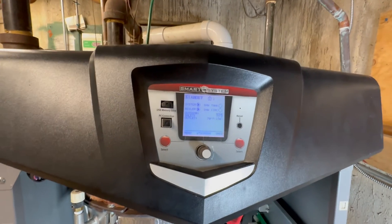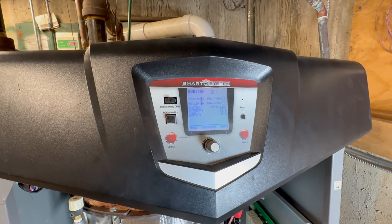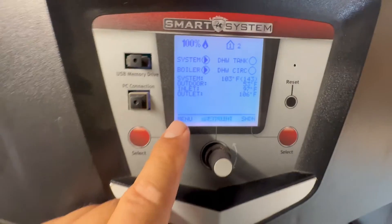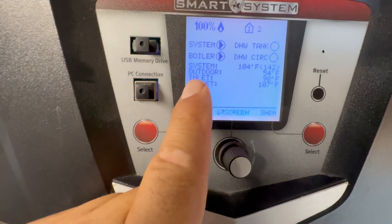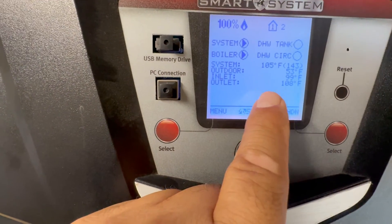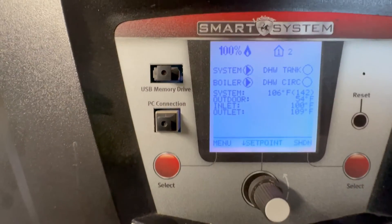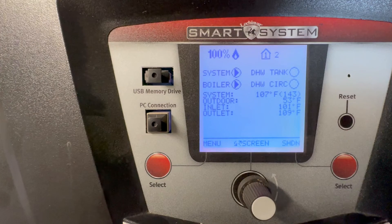Look at that — it's working! Ignition. It's working now. If you see there, it says inlet is 97–98°F and the outlet is 107°F. Before, the inlet was not recorded — it said 'none' — so that's why it said the Delta T was too high: we didn't have any number for the inlet, so the computer said something is wrong and called it Delta T too high and went into lockout. That's it — it's working now. Please don't forget to like and subscribe if you can; that would help me a lot. Thank you so much and see you in the next video.